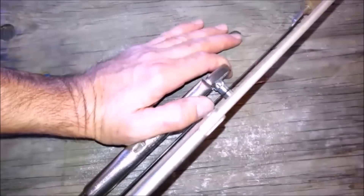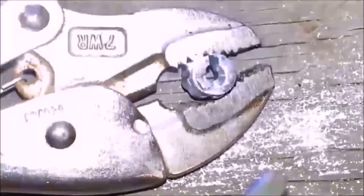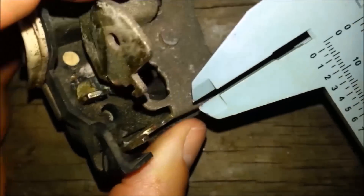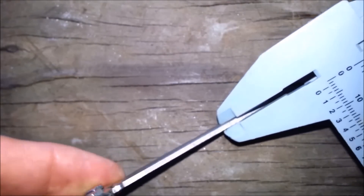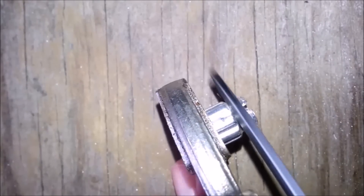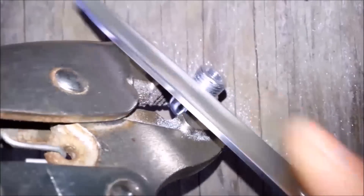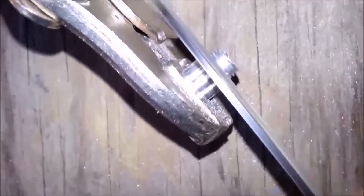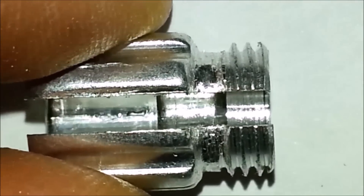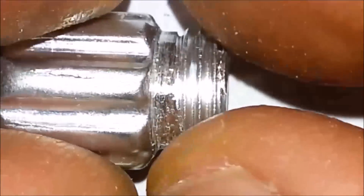For this latch, I need to cut the adjuster to length. The adjusters I'm using are a soft metal, so I can cut them off and file them smooth without a lot of effort. The metal this latch is made of is about 2mm thick. My multi-tool has a file that's just a little thicker than 2mm, and I'll use it to cut a groove in the adjuster a little wider than the metal. It's okay if the groove is wider than 2mm — just try to make a fairly smooth and even shoulder on the thick housing side of the adjuster. File the groove all the way around the shoulder. On a 10mm adjuster, filing down until the threads are gone is just about right. This is what the new housing end looks like. The groove around the shoulder slips right into the slot, and the threads on the end hold the adjuster in the latch.